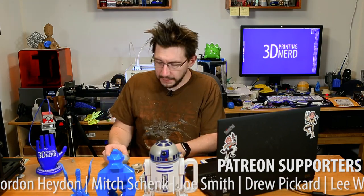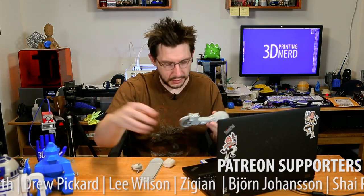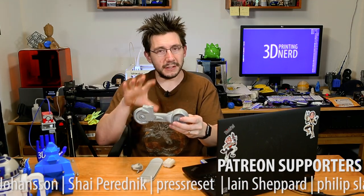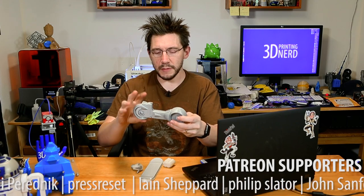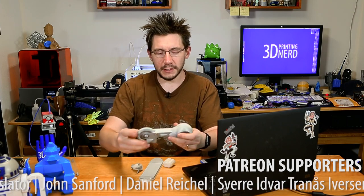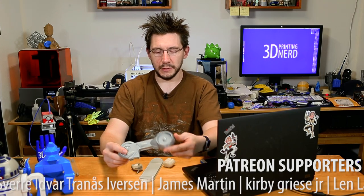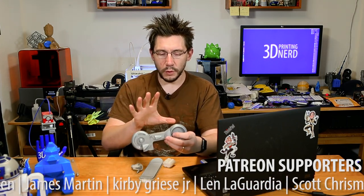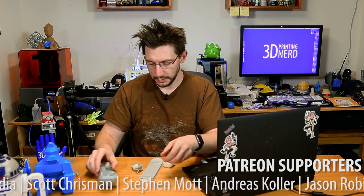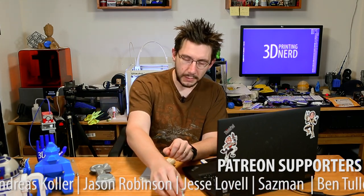I do have a dedicated video coming out on this but let's move these guys aside. Sorry R2. This is a Tron light cycle — it doesn't stand up, but I just put this in Cura and told Ultimaker to use PVA supports. I'm saving the close-up for the video, but this is a bottom layer for that support. The tip of this wheel was the only thing touching the build plate and it built everything out from that — how smooth and literally perfect the bottom layers of this model are. It's crazy impressive. That's how PVA builds it up.